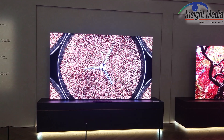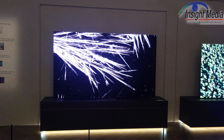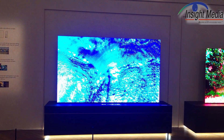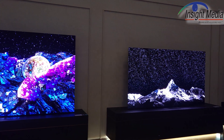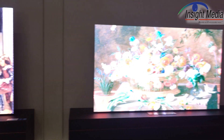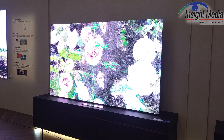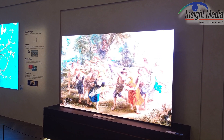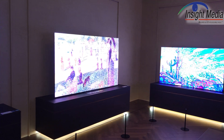Each of these are made with a module that's about 12 inches in diagonal. It's a glass module, so it's low-temperature poly on glass. For the module size of the LEDs, they don't say specifically what it is, but it's less than 50 microns. And they're rectangular, so you can do RGB. These are using, in the manufacturing process, discrete RGBs with gallium nitride green and blue and aluminum gallium phosphide — the traditional red LED.